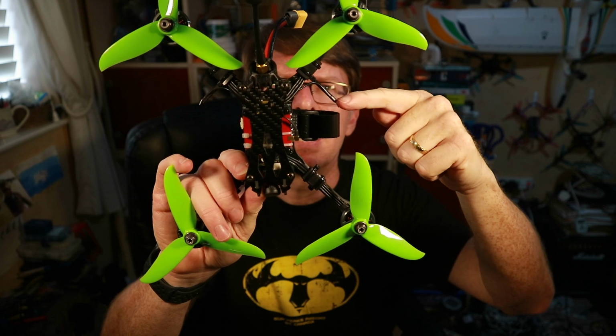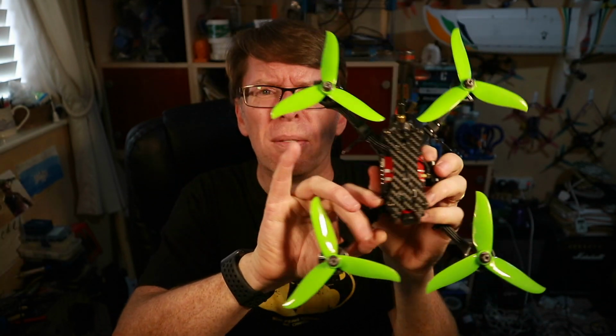But from that we got various models of FrSky receivers, and we had the very popular X series of receivers, especially things like the XM Plus, which worked really well in quads, because we're talking about these little stumpy antennas here. We could still fly a quad to about a kilometre, even if we hadn't placed things brilliantly, and we're not dealing with very high latency from the S.Bus signal it would give. So that was a pretty good solution for us.